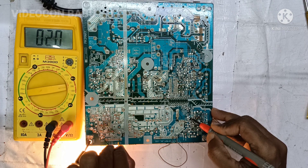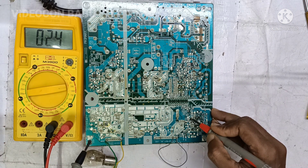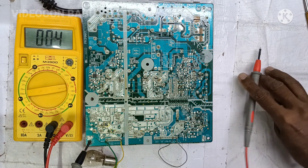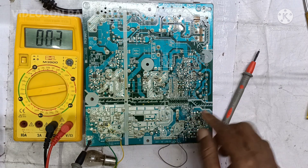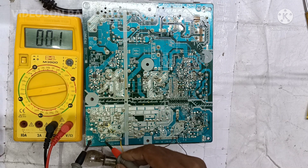So this is the problem in this power supply. The problem may be in the secondary or in the primary side. The technique to verify whether it is secondary or primary is to check the reference voltage and the feedback from secondary to primary through the optocoupler.